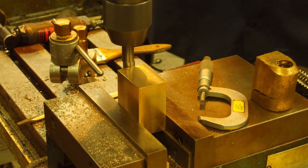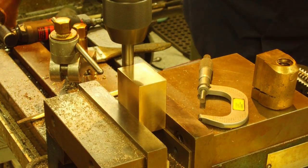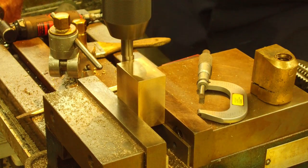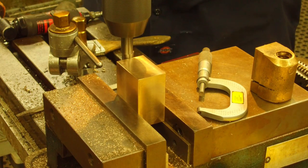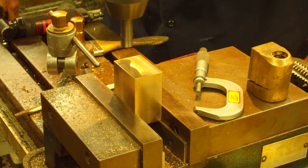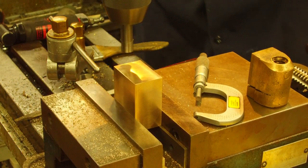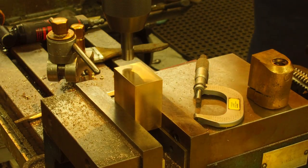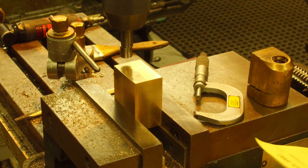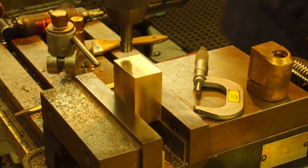Okay, I said zero there. All right, and we always double check. We want to make sure our knee is locked too, because we want to check that without any sag on the knee. And it's right there as well. All right, and we're going to call that zero. Now our distance over to this location here is 1 inch 46 thousandths.